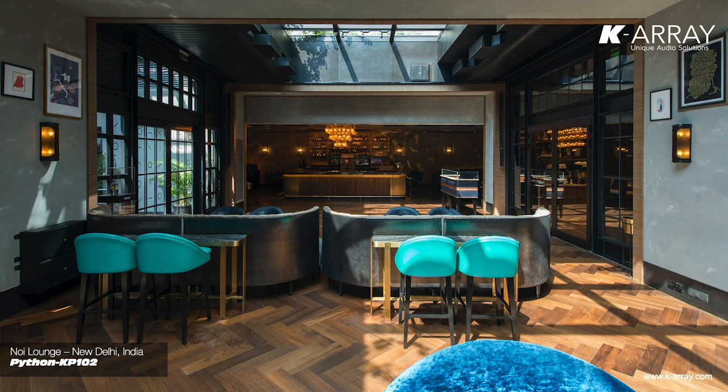Going to India, in this beautiful lounge in New Delhi, you realize the room is almost 20 meters long — about 60 feet, more than three times what you see in this picture. Should we distribute many small speakers all around with all the cabling cost? No — we stay in the four corners of the room but with even longer arrays, joining two columns together to create a two-meter-long array that can travel really far and cover the entire room homogeneously.